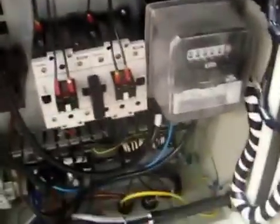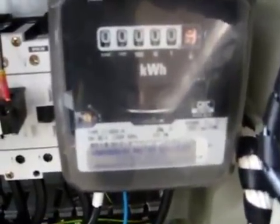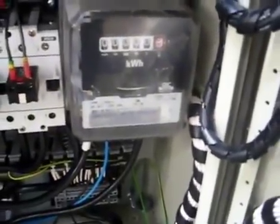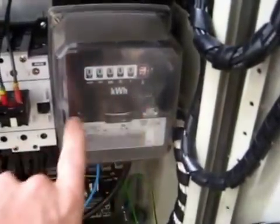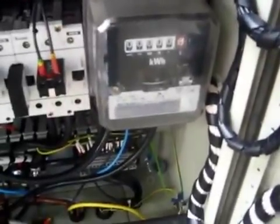We've put one of these meters on — it's an energy meter commonly found in UK houses. In the center is a disk. When power is coming from the generator, the disk will move in that direction. When power is coming from the grid, it will move in the opposite direction. This meter has a little safety feature to stop people from reducing their electricity bills: it's only allowed to do a couple of rotations in the wrong direction before a mechanism jumps in and stops it.